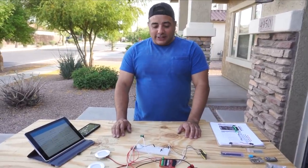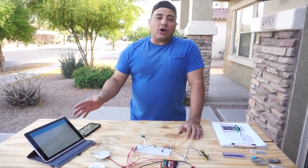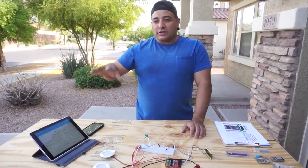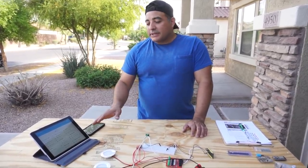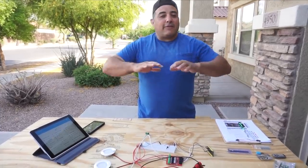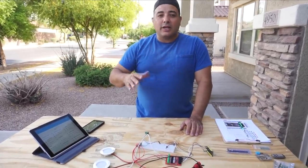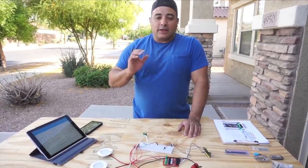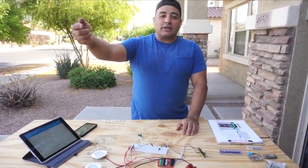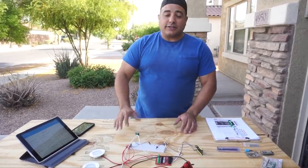So a good example of graceful degradation is the way we wire our lights. What we're using is Home Assistant, which is already a decision, because most of the other home automation platforms have to go out to the cloud and then come back to operate things like switches. Home Assistant is very focused on being a local-first type of system where even if you don't have internet, everything works the way you think it should work. Everything communicates via the local network. Everything still functions with no internet connection. Then when you use the internet connection, you're actually internet porting into your system, rather than your system going out to the cloud, doing some computation, then issuing a set of commands back into your system or your environment.